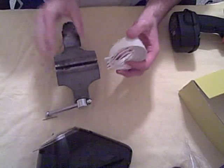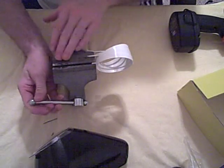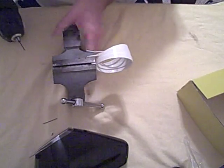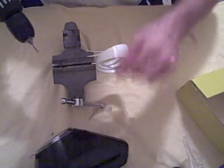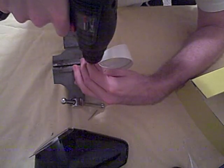First thing you want to do is go ahead and take out the speed feed. What I do is I take my speed feed and I put the tab in a vise — the very end of it. Now what you're going to want to do is, using a small drill bit — the drill bit I'm using right here is a 1/16th drill bit — drill a hole almost at the very end of it for you to put your pin through. At the very end, you want to make sure you get this perfectly lined up because if you're off-center you could ruin your speed feed.